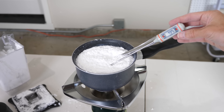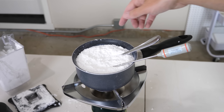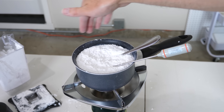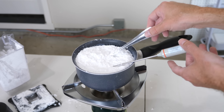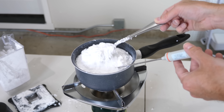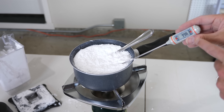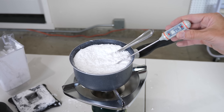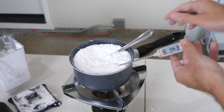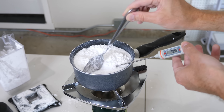We're at 79 degrees Celsius and I'm seeing some steam forming now. It's weird — it's not actually boiling, it's kind of just blowing steam out the sides and you can actually see the powderized fumed silica coming up. It's just forming an actual powder. 99.7°C is actually the boiling temperature at my elevation here, very near sea level. So we're at boiling temperature right now, but I don't actually see any bubbles forming.